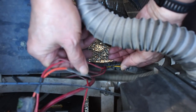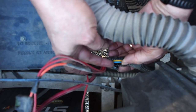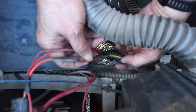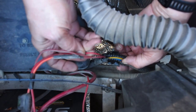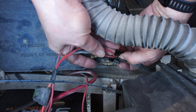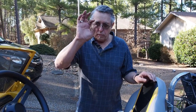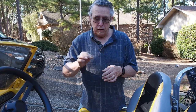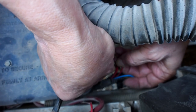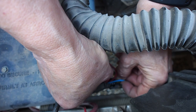These are the blue and red wires we're talking about. This blue wire here would be stripped back and jumpered with the red wire — that would turn the power on. Since I'm going to make this temporary, I'm just going to take a small pin like this and pierce right through both of the wires — first through the red wire and then through the blue wire.